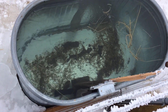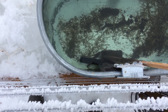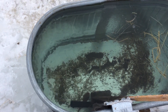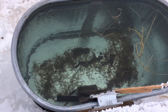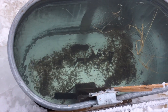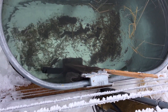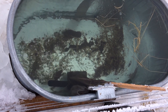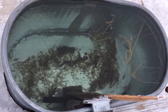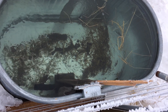One thing I did — it wasn't working and I was still getting ice on top — I added that hose, and it kind of directs the water up so it makes more of a surface disruption. The other one was just swirling the water around in a whirlpool and it was still freezing over. We were down in the single digits close to zero on a couple of those days. This morning it was 19 and there's just a little bit of ice floating there — some around the edges but it's working pretty good. I still have to get the hardware fabric or screen to go around the pump. I'm still using that painters cloth as a filter, but you can see it filters the water nicely and it's nice and clear.